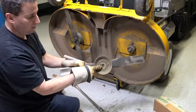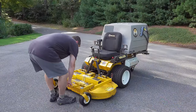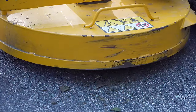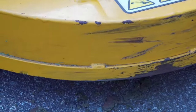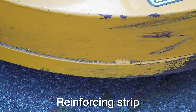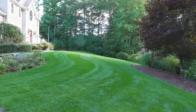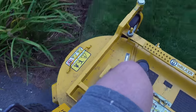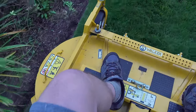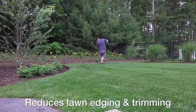This is very unusual, and if you're a commercial landscaper, time is money. As we lower the deck, we see something else — it's a deeply drawn deck with an extra band around it. That comes from Walker and is designed so that if you hit something, that extra steel protects the deck from getting dented. The deck also extends past the wheels, which means you can mow into places like your beds and even under trees — so oftentimes you can just mow and don't have to weed whack afterwards.